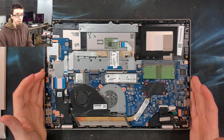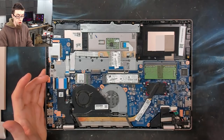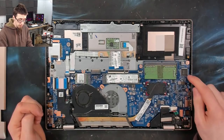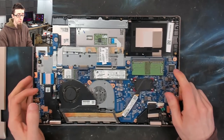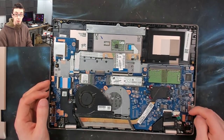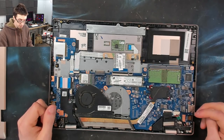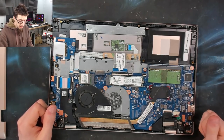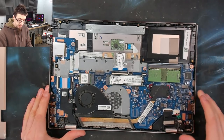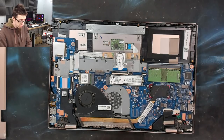This could very easily be a BIOS fault, because it's the BIOS's job to check the memory. The EC — the embedded controller — that's this ITE chip over here. The EC is waiting for the BIOS to respond and say "yeah, we're good to go, all systems power on," and it's not getting a reply. So my next guess is that the BIOS is gone on this, and we're going to start approaching that.